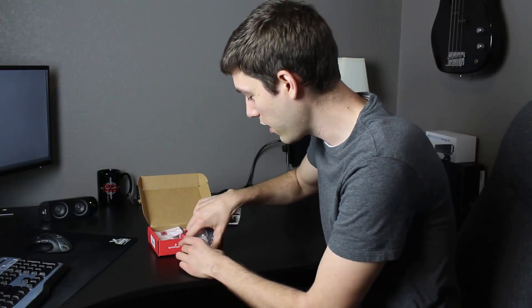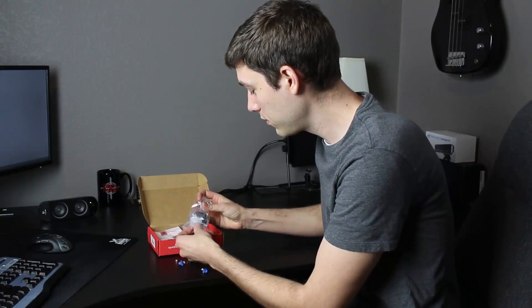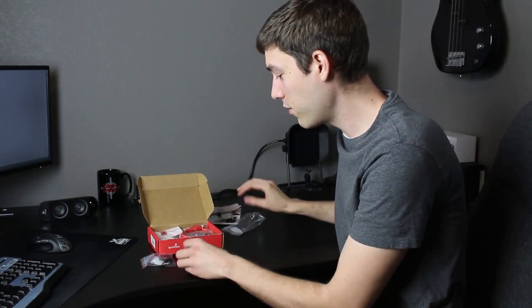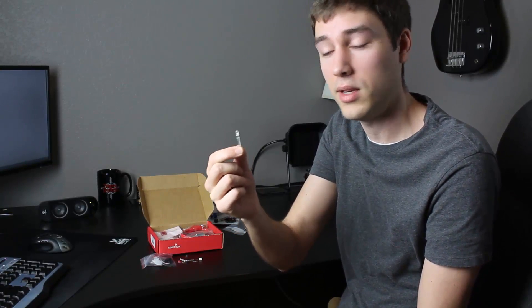In this bag here, we have a number of things. We have a couple of push buttons, and three potentiometers — this will generate an analog voltage as you rotate the potentiometer. There's also a buzzer for generating sounds, and an RGB LED, so we can set up to 16 million colors by PWMing the R, G, and B pins of the LED.